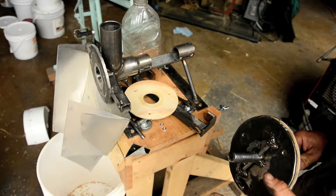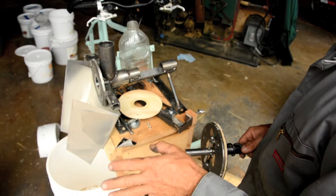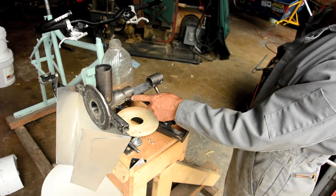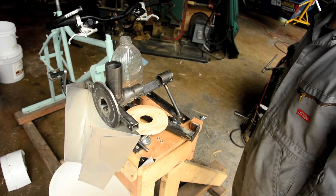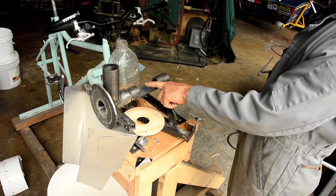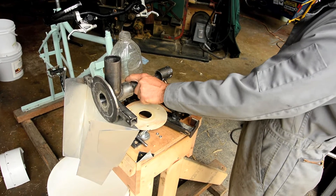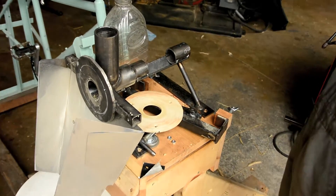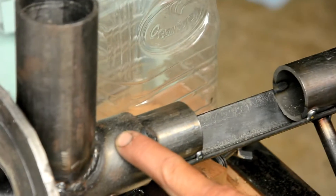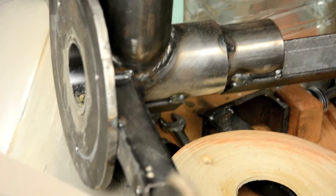In places where distortion is a factor, I tried to keep the amount of welding to a minimum — the welds are barely more than tacks everywhere. This piece of pipe is sized so that a very inexpensive but high-quality go-kart bearing presses into it, and the other pieces of pipe are sized so that the auger works well in those sizes.